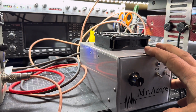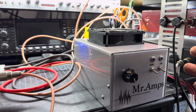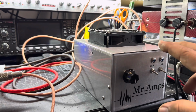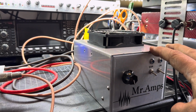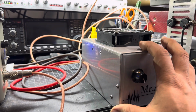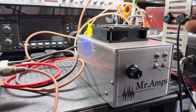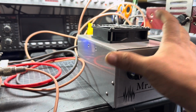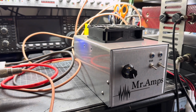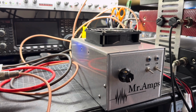They're very nice amplifiers if you really take care of them. I see some transistors getting weaker, and they get weak because you overdrive them. You're increasing the voltage, and we're not supposed to go over 12.8, for example. That's the way they test these transistors, at 12.8. Yes, you can increase it to 16, even sometimes 20 volts in there. But how long is it going to last?